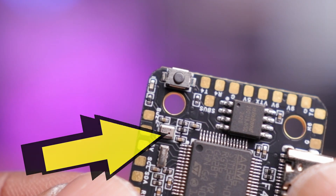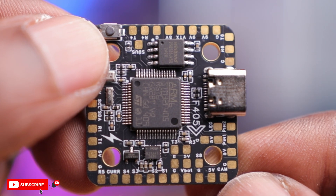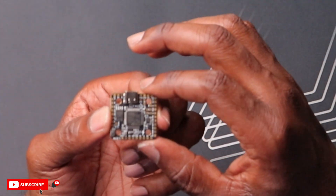There's also a barometer with a small pinhole visible. The gyro is the ICM-42688P. With Betaflight's tuning software, the specific gyro doesn't really matter much — most interference comes from how you mount it and the drone itself. We'll see how it actually performs once it's installed in a drone.